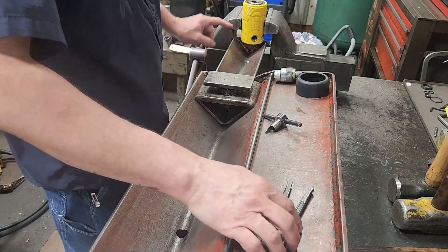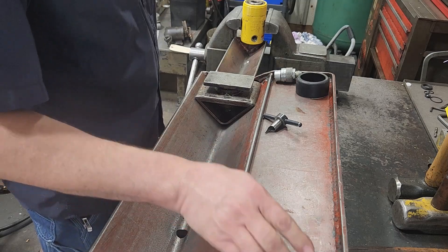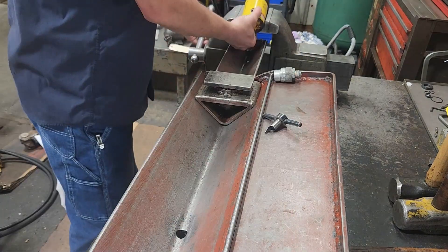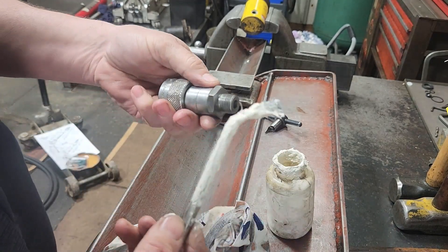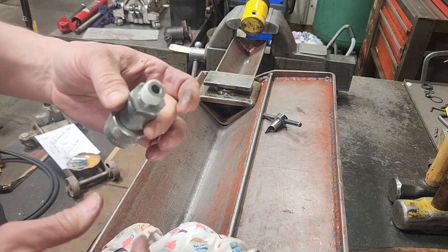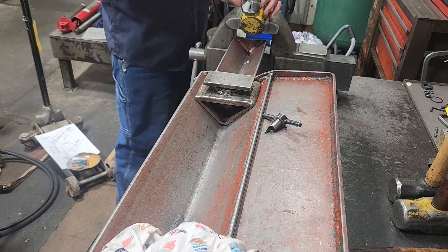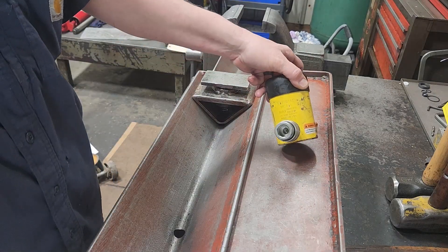Then it's just a matter of snugging your ring back — don't over-crimp on the outside of the wall. That's pretty tight already. Put the protector back on, then clean up these old pipe threads. Put some thread paste — pipe dope, PTFE paste, whatever you want to call it — on there, tighten it up, and that's it. That's how you reseal an Enerpac RC151, 15-ton RAM.